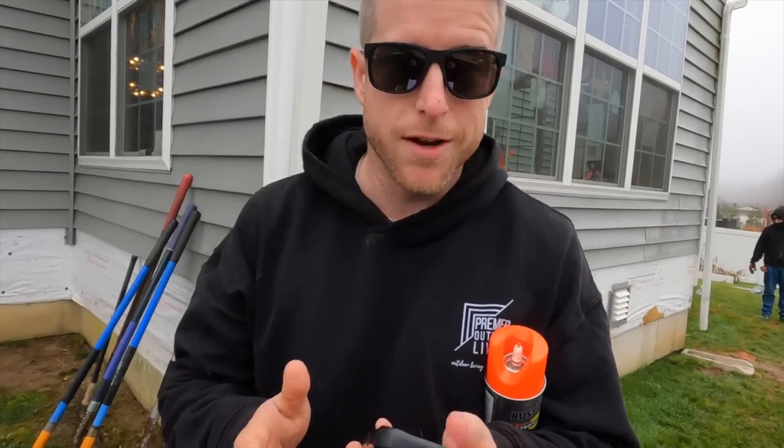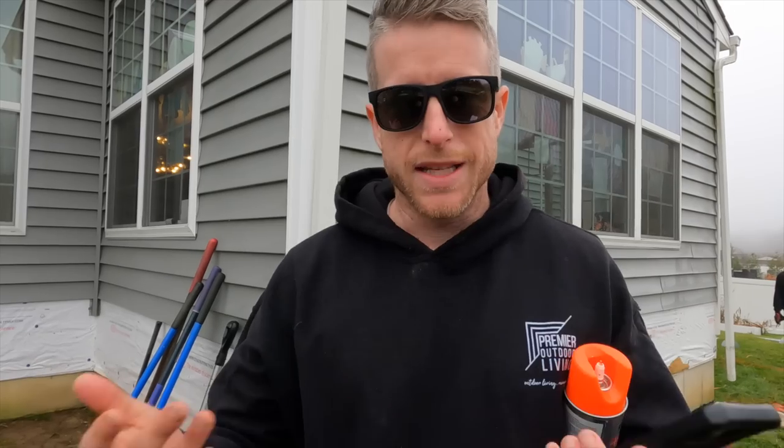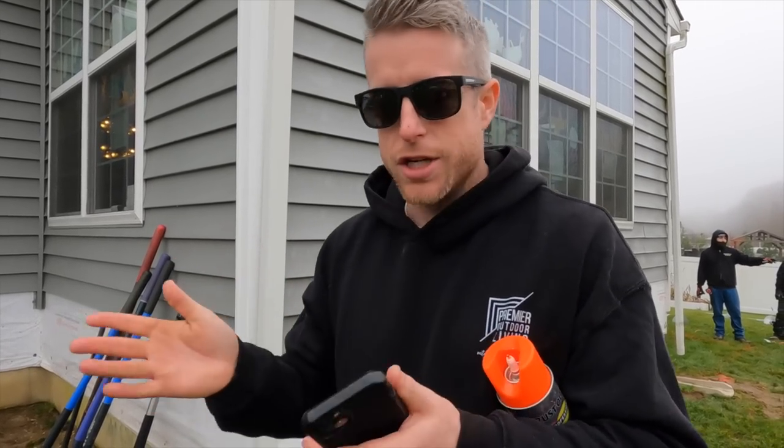This is where the roof is gonna be. So these are gonna be the most critical. We have a couple posts that need to be right in the corner. So that's what I wanna be careful about and make sure that we take our time, lay this out right. With the deck, a lot of times it's pretty easy because the beam is gonna cantilever past our footings and our joists are gonna cantilever past our beams. So we just need to be right in the ballpark, but we can be off by half inch, an inch, not a big deal. Here, we need to be dead on.